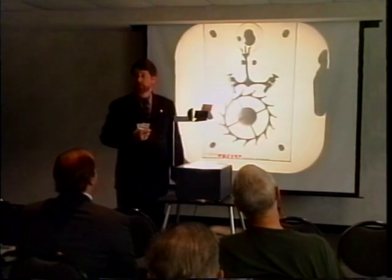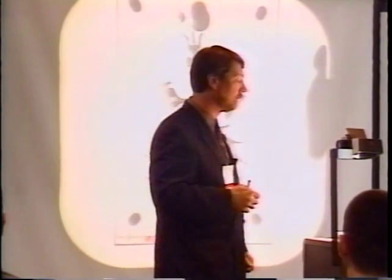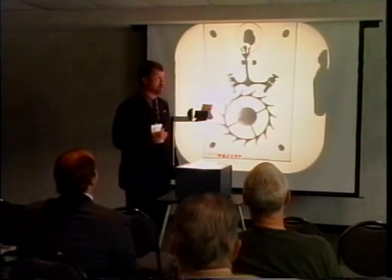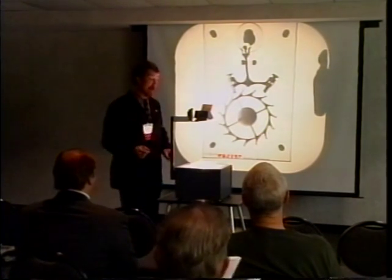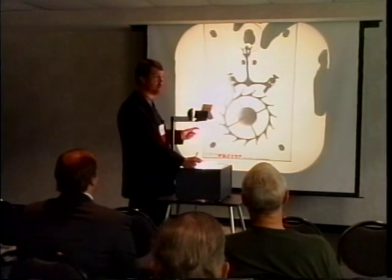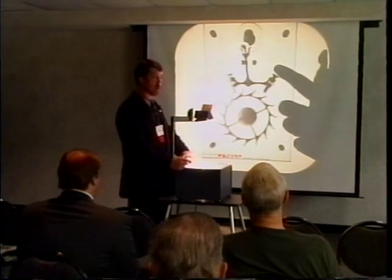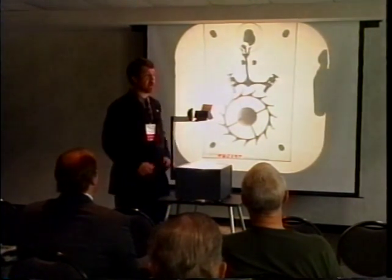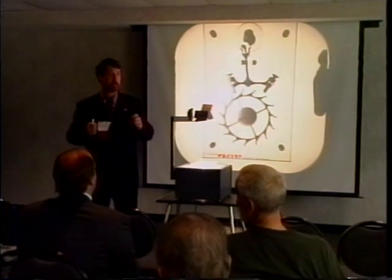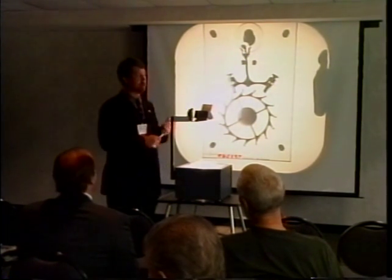And what is it that we're fighting in mechanical timekeeping all the time to have a consistent rate? Friction, okay? So when we talk about generalities of the total lock being one-third of the impulse surface, in reality, your watch might be able to have a quarter of that. But if you have one-quarter, you still have to make sure that you have the safe total lock arrangement. So the point is you want all your tolerances to be as small as possible, but at the end of the day, it still has to be safe. Safe fork horn clearance, safe guard pin clearance, safe total lock.